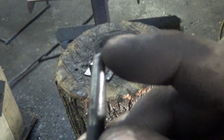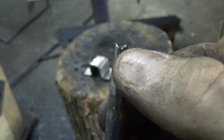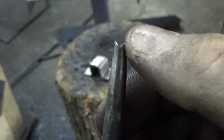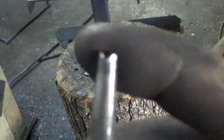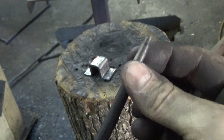Depending on the material that you're cutting, I usually cut 1/8 inch or thinner with this. You're already through by the time you get to the bottom of the cut. You're already through in the tips, so it makes the punch easier. That's my point. If you want cold punches, you can punch steel up to 1/8 inch thick. The small punch is like 1/4 inch diameter, like this.